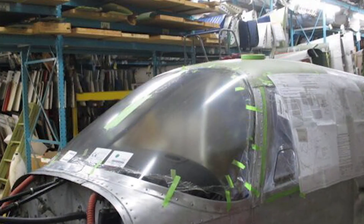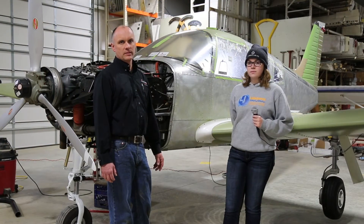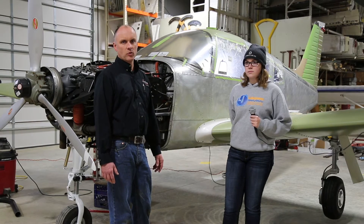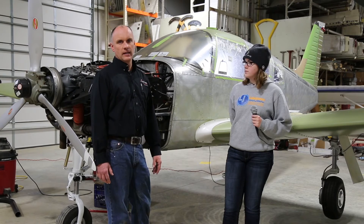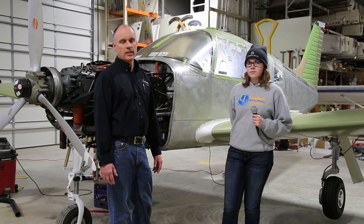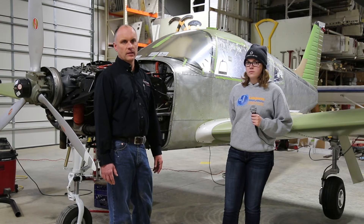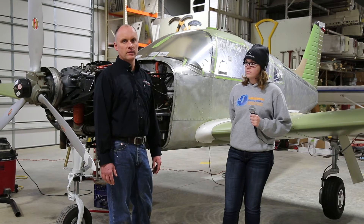Quarter inch thick, 0.250, on the windshield. We've installed the Casola one-piece windshield on the front, taking out the center bar and installing a one-piece window — this will give the aircraft a more sleek look. Before the windshield was installed, we put new vinyl on the glare shield, new material in there, changed out all the ducting for the defrost, changed out all the fittings on the pull handles, so once the window goes in we have all brand new items underneath the glass.